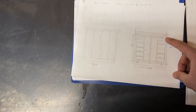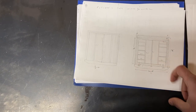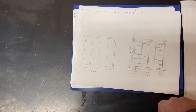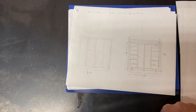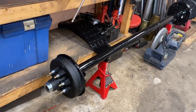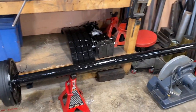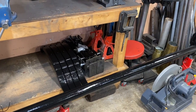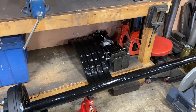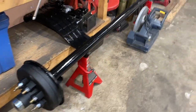The interior height is going to be 92 inches from the floor to the top interior. The walls will be made out of .050 aluminum sheet and the floor out of 1/8-inch tread aluminum plate — no wood. I already received the axles and tires. The axles were custom ordered: center-of-spring to center-of-spring distance of 74 inches, and hub-face to hub-face distance of 90 inches. These are 7,000-pound axles with 9/16-inch studs.